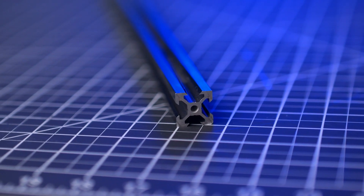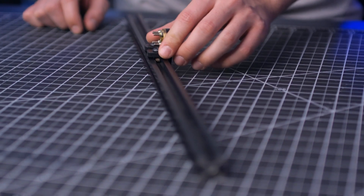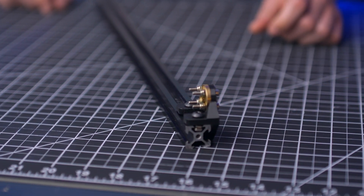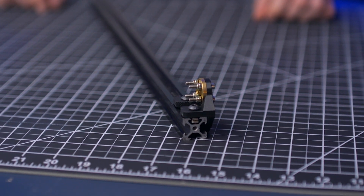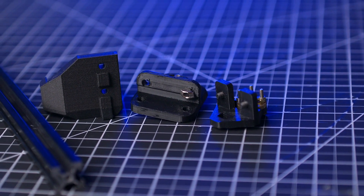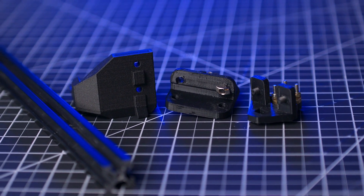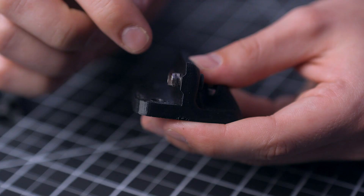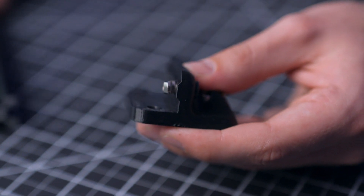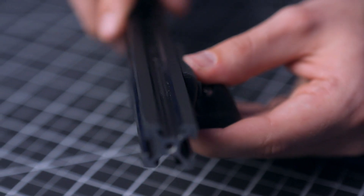For example, let's say I'm designing a part that needs to be mounted to aluminum extrusion with T-slot channels. T-slot allows you to mount hardware after assembly instead of in the middle, which is why a lot of inexpensive printer kits feature them in some way. A small tab can help align the part onto the extrusion, but with a flat bottom this is going to droop. While it won't be pretty, at least it doesn't affect the structure of the part enough to warrant a reprint. Instead, add a chamfer to the bottom until the horizontal surface is gone or at least significantly minimized. This also works well for any holes in the print, like bolt holes.